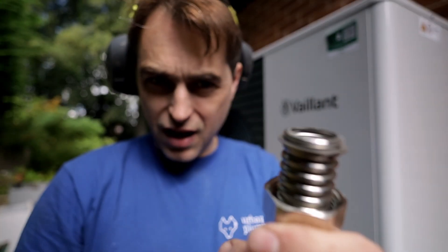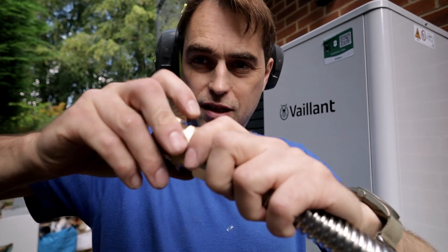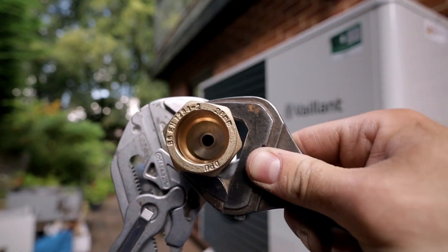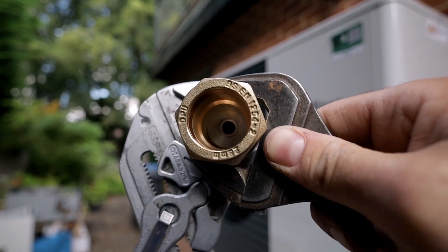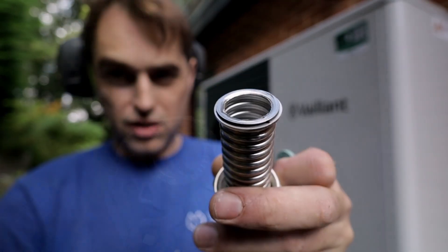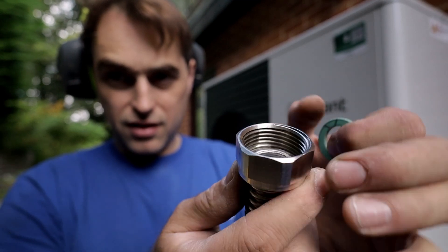Slide the nut back up. I'm going to use a big flat washer, put it inside the pipe, and use a fitting to flatten the corrugated steel pipework. And here you have a perfectly flattened corrugated steel pipe.